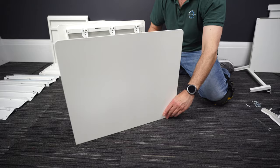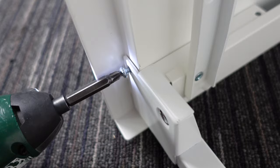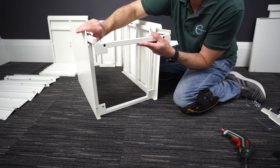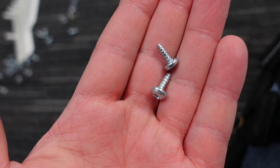Now we're gonna have those two holes here, and you're gonna need two of these screws with a round head. The drive is slightly different than on the previous screws. Secure the legs at the bottom, one screw on each side. On the top we're gonna use the ones with kind of rectangle squares at the bottom. Slide them in on the top of the side panels, one on each side. Slide completely in, and secure this side as well through those two holes with exactly the same screws as we did at the bottom. Secure them completely in.